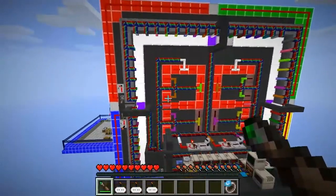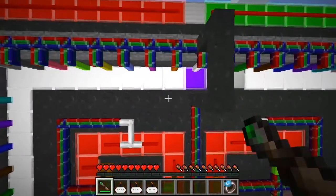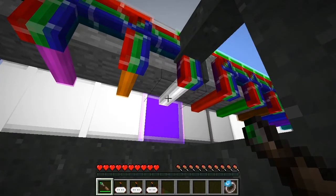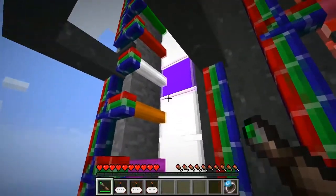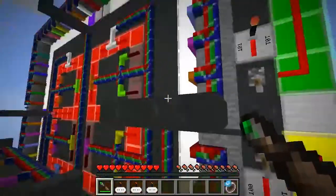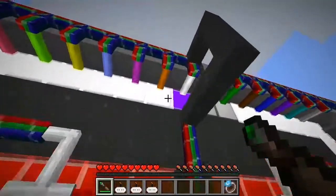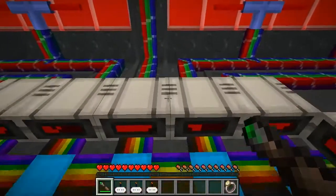There's 4 segments basically of the seconds displays because you can only have 16 items on a bus, and I need 60 of them. So every 15 seconds is on its own bus, and they're actually each wired the same way. Going in order, starting from the top, this is binary value of 1, 2, 4, etc., all the way around until we get to the next 15-second segment, and that's how they're all wired together. And then we've just got jacketed bundled cable, just so it looks fancy, and one more up to the top. Those are set up on ID 10, 11, 12, and 13.